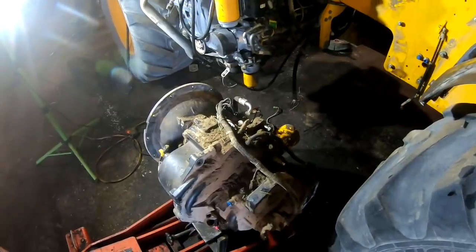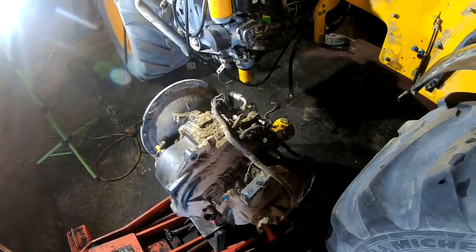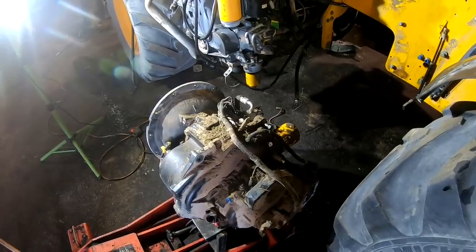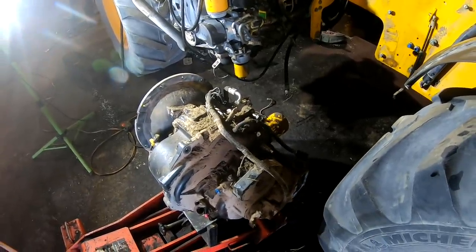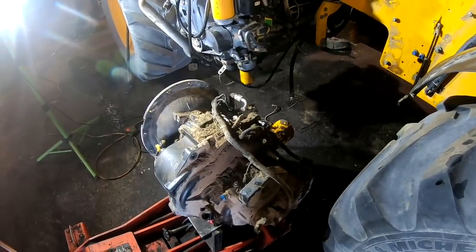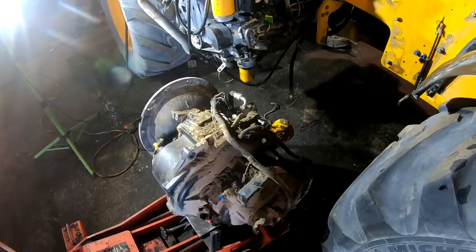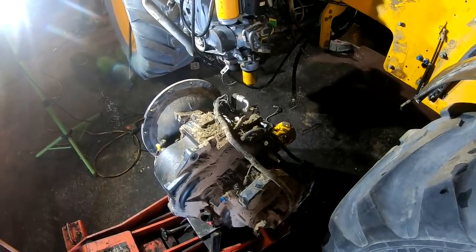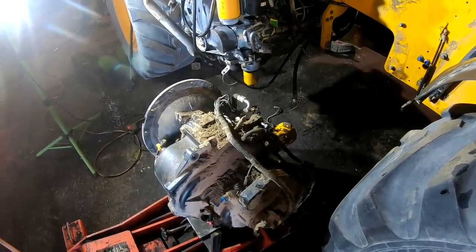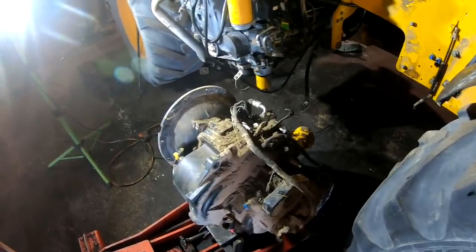But usually when you get a shift valve block like that, I know on John Deeres, if you're putting partial oil to a clutch pack, then you better just go ahead and disassemble it, because more than likely you didn't have any lube oil going to it. You had partial oil going to the clutch piston, so it'll let them slip and it'll burn them up. So you might as well tear them down.